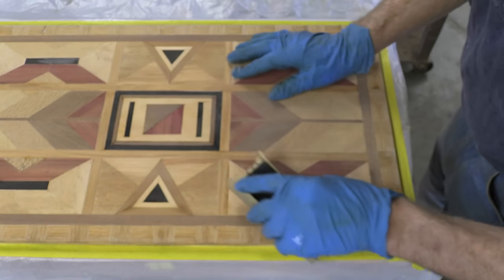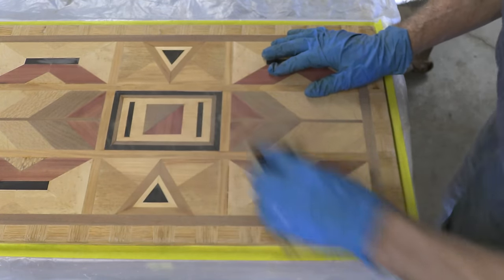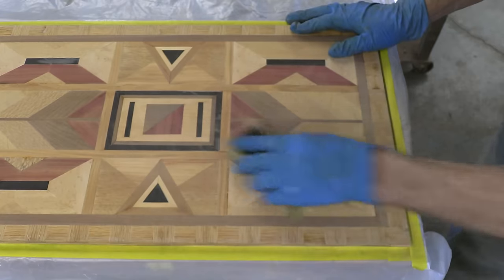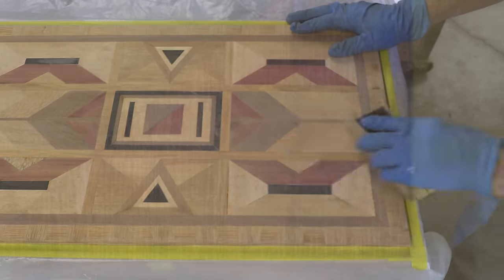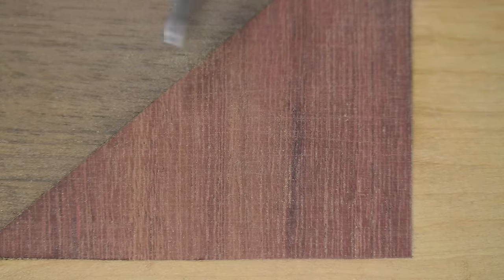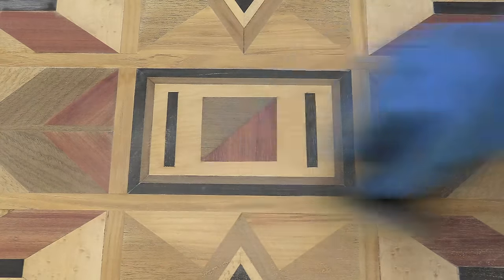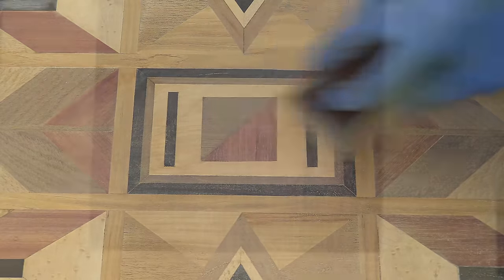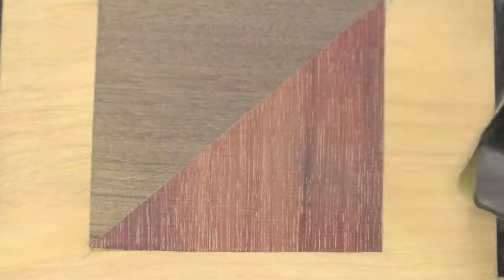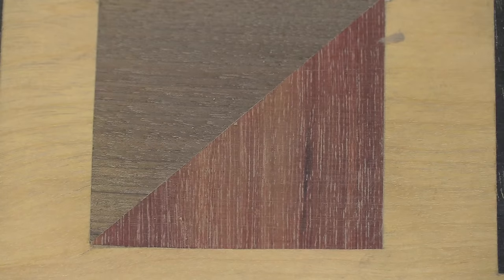When the wood's been treated with so much water, I like to sand at a 45 first, just a little bit, to knock the grain down, and then straight. I'm hoping you can see here the 100 grit scratches going cross grain. So I'll sand with 150 until those are gone. It can be difficult to tell, but I think I've replaced the 100 grit scratches with 150 scratches now.